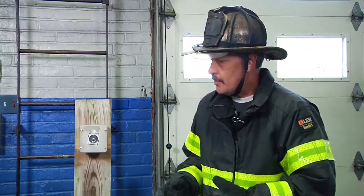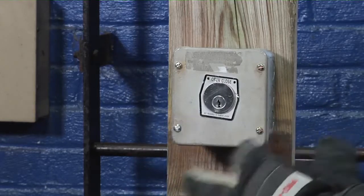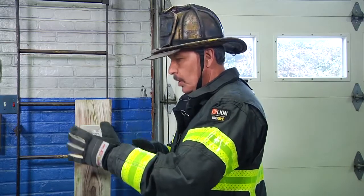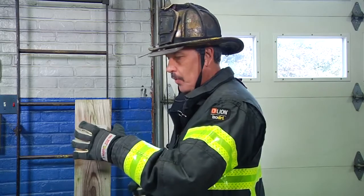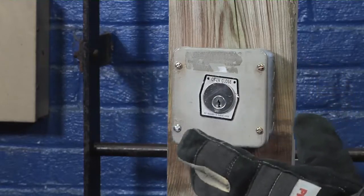One of the big things here is it's 4 simple screws. We'll take a simple Phillips head screwdriver, a flathead, depending on what they use, and we can take out the 2 top screws. And maybe that gives us enough play to use a little hand tool to move the limit switches. If not, we can take all 4 screws out, pull this out. The wiring isn't going to let you pull it far out, but we'll be able to pull it out enough to get a hand tool in there.